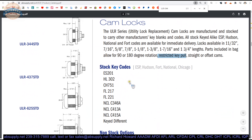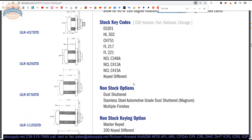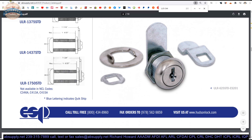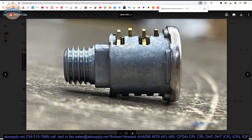You also heard that to make it key retaining, those plastic pieces are not in this package — I can't explain why. I know that the client does not require key retaining, otherwise that would have been an issue. There ought to be plastic shims. What those plastic shims do is fill the area where it's open here, so that when filled, you can't pull the key out because there's no room for the tumblers to leave the cylinder plug and up into the housing, because that space in the housing has been filled. And that's how that works.